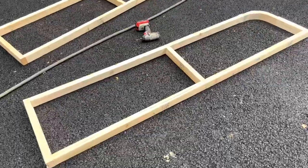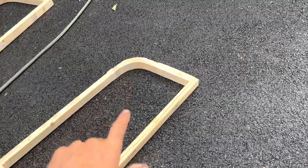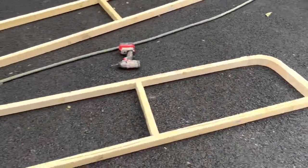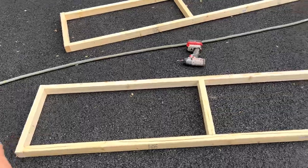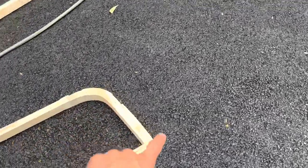I got some frames built. Now what I'm going to do is cover these with the one by fours and I'm going to get this end down here flush. I'm going to let them stick out long down here, then come through with the flush trim bit and flush trim that entire corner perfect.